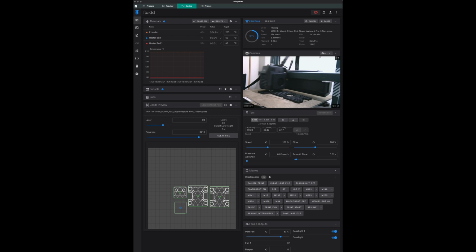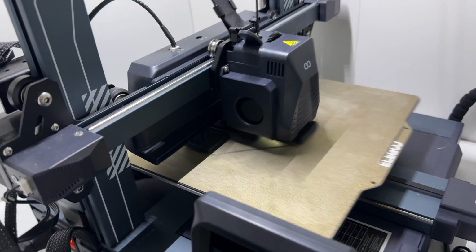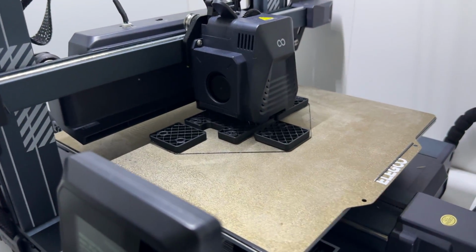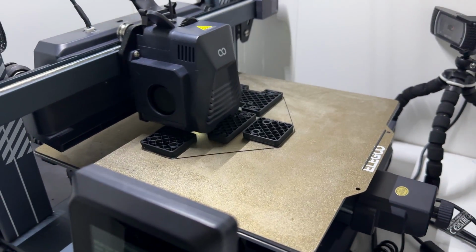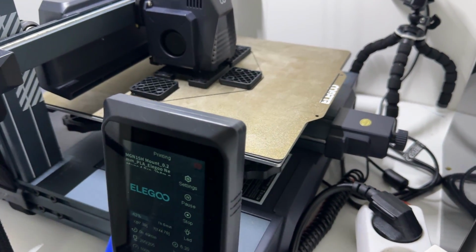First of all, you'll need some additional things to set up a linear rail upgrade for the X-axis on a standard 3018 or 3018 Pro CNC. I'm also assuming that you have some kind of an upgraded Z-axis for this setup. If not, you will need some extra parts fabricated. Luckily, this is an area where there's a ton of DIY people sharing their creations, and you will most probably find something that can suit your setup already available at Printables. And of course, if you know how to use simple 3D modeling software like Onshape or Fusion 360, you can create your own parts there.